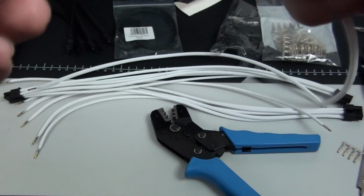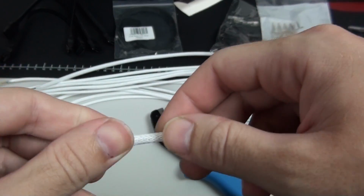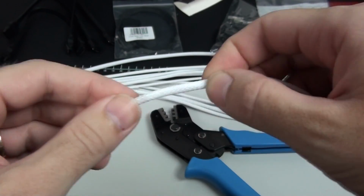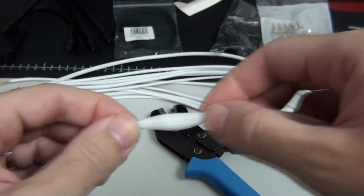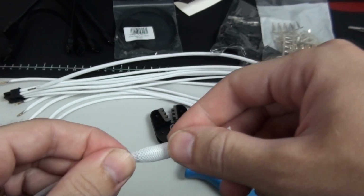I'm now going to briefly take you through how to do heat-shrinkless sleeving. So if you're doing custom wiring and you're building the cable from scratch, you need to cut the wires, strip the ends, crimp the pins on, and then prepare your sleeving. Now all of that I just mentioned is a big process. It takes the correct tools. You need to be incredibly meticulous.